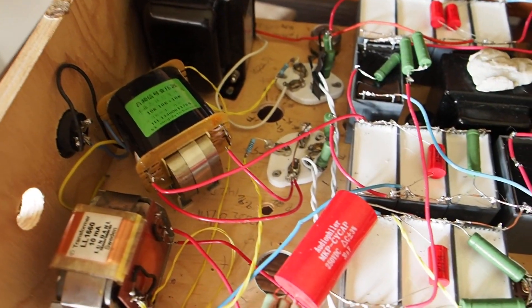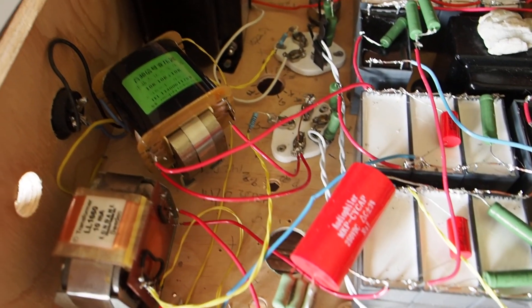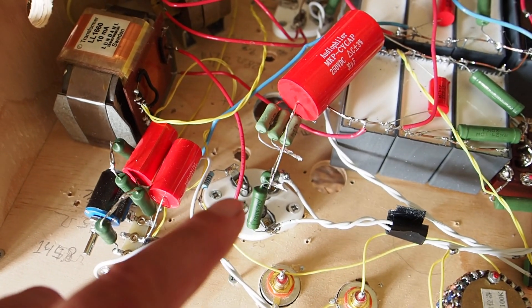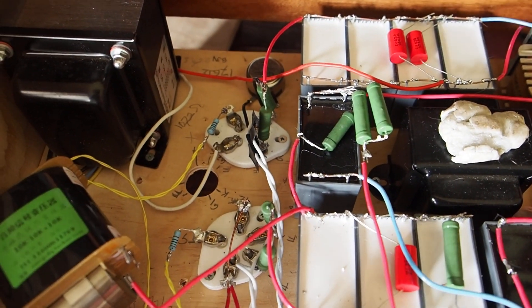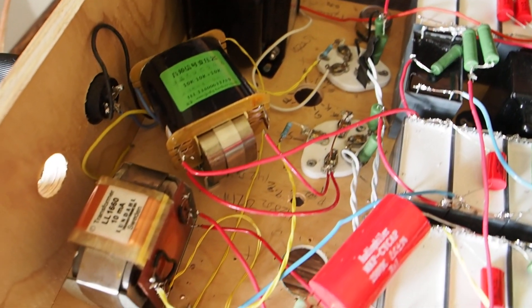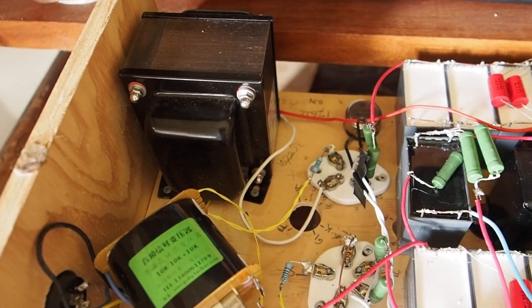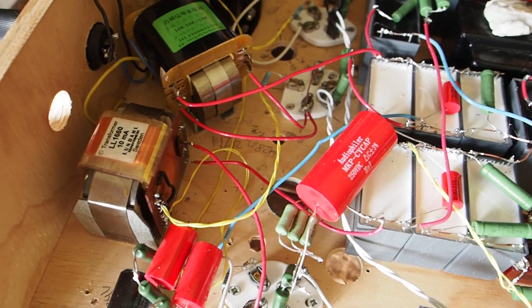Power tube drives power tube. I'm using a very good input tube to drive the smaller output tube, stepping up in a fashion that seemed correct. The plate resistance drops over the tubes: probably around 7,000 ohms for the Type 26, about 2,400 ohms for the 46, and then the Type 50 at around 1,800 ohms plate resistance. So it steps up really nicely. The concept was: work back from how to make the Type 50 function optimally, then how not to influence the stage before it — and so on back through the design.